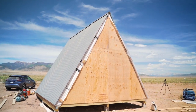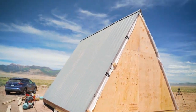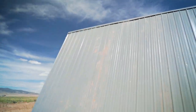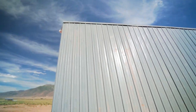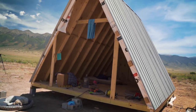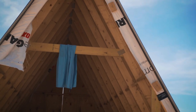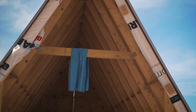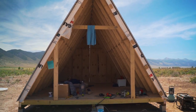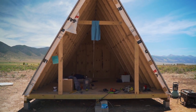It is now Friday morning. Finished up the rest of the sheathing — haven't gone into town yet, so it'll be a little bit before I can finish off that wall and cut out the slots for all the windows. I started on the front side, basically putting in these two uprights — two by sixes — which are going to be what the doors hinge off on each side. The rafter tie my tail is hanging off right now is basically where the loft is going to go across. There are going to be six of those; I'm just doing the end one here for now to finish up the support on this final A, and then I can start making the doors and sheeting the sides.